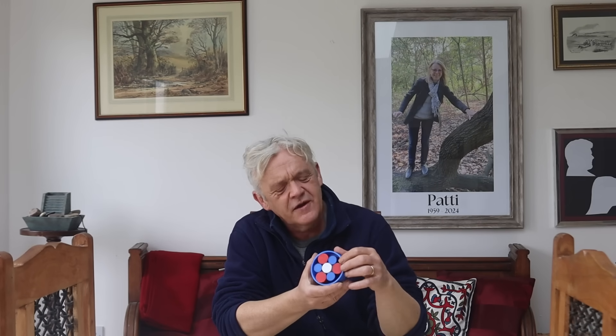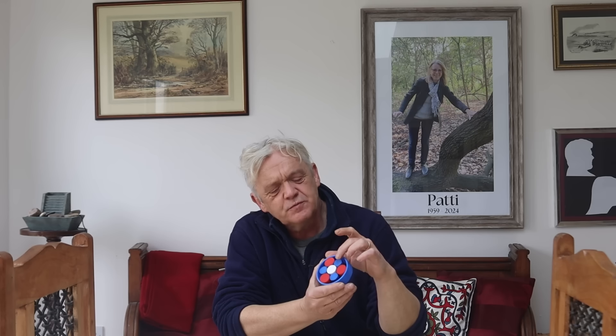The major advantages of a system like this are that it's very tolerant of inaccuracy. As long as the blue rollers can't cross the centre of the red rollers, which grip and squeeze them outward, it doesn't really matter — it's self-adjusting. They squeeze out and hit the cage walls, so it's quite tolerant. It also doesn't need any lubrication and is very efficient at transferring torque, or so Sandia claimed at the time.